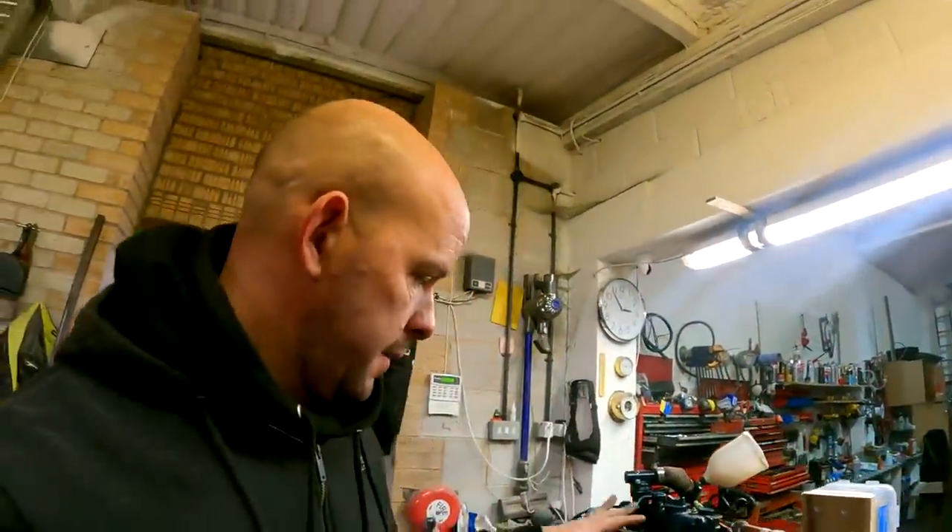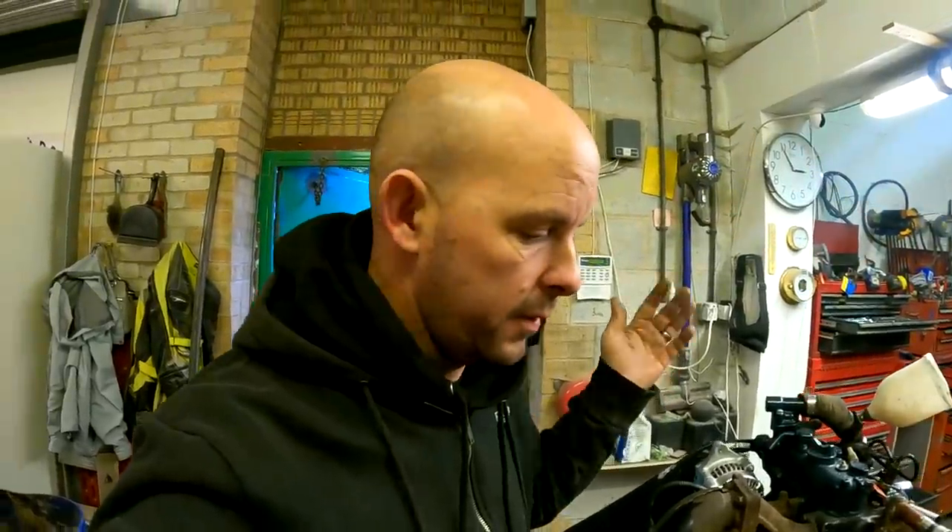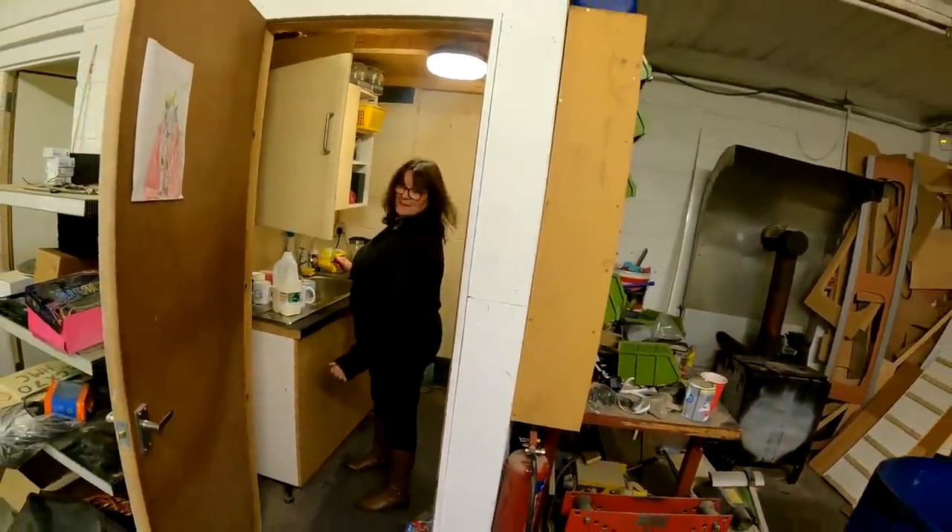Next time we're going to be finishing off here — I'll probably finish this off camera to be honest. Then we're going to be making a new exhaust with a heat exchanger. Going through the heat exchanger will be antifreeze, which will then go through another heat exchanger using raw water to cool the coolant. That's the only way of really doing it when we're out of the water. But instead of raw water we'll also use another antifreeze circuit with a pump going through a radiator hung over the side of the boat, or in the cabin, so we could heat the boat. Thank you very much for watching, and thanks to mum for doing some cleaning and making a bracket. See you next time, bye bye.